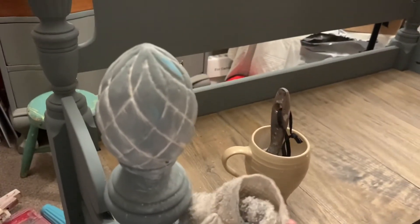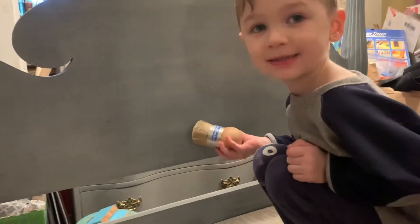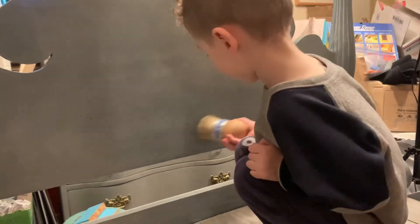Looks lovely. Then you're just going to wipe it back — it'll leave kind of a white cast over everything but leave actual white in all the grooves and details. If you don't want any of the background to come through, let the paint dry for longer than I did. Then we're just sealing the piece with some more wax. This just wasn't going to get a ton of wear and tear — I wasn't worried about people setting drinks on it — so wax was a perfectly acceptable sealer for this piece.